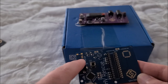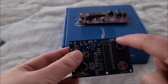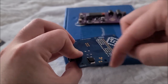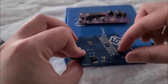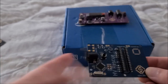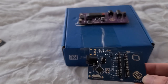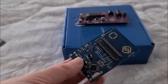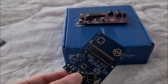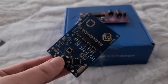Both of these boards are based off other people's designs — all I did was design the circuit board. The HV rescue works great, no issues, but it requires a 12-volt plug pack. I put a USB port on it with plans to include a boost converter for 5-to-12V, but I never got around to that. I've used it to recover five or six chips I accidentally locked myself out of.